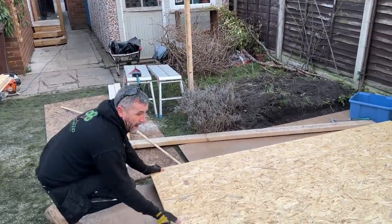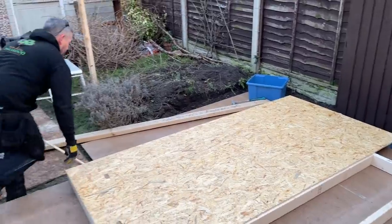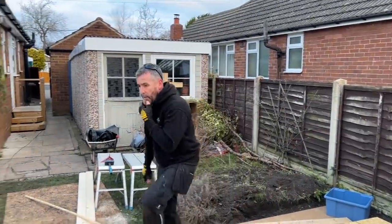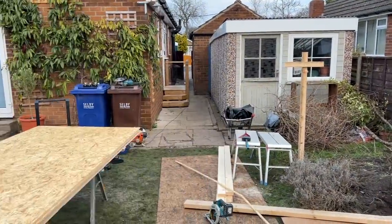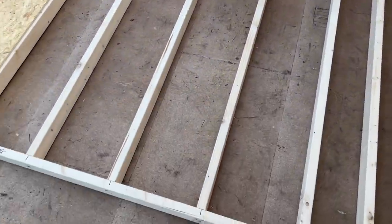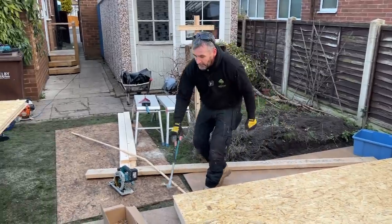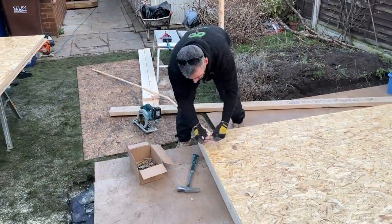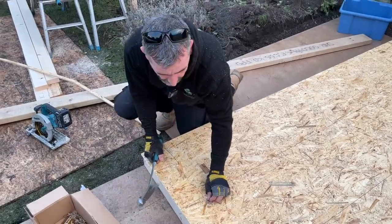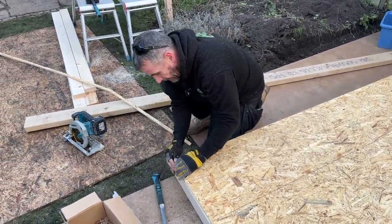You can see it's way long there. I'm using 63mm ring shank nails — we haven't brought the nail gun so Davy's had to strip the nails down by hand. We're going to nail them every 400mm or so down there and that is going to be absolutely solid.